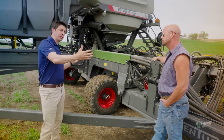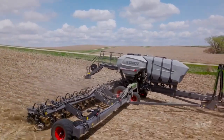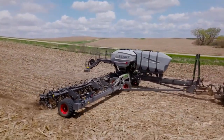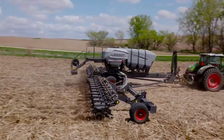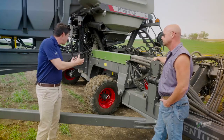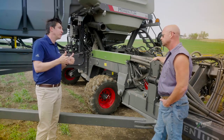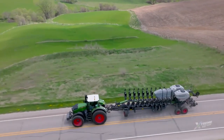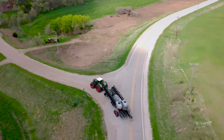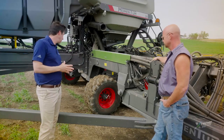The weight we're measuring on the planter isn't just feeding the weight transfer — it's feeding the tire inflation system. As we're planting in the field, the tire inflation system goes all the way down to 15 psi, stretching and elongating that footprint. When we have a bigger footprint on the ground, there's less compaction and more traction. When you finish the field and fold the planter, we know you're folding and going to road, so we'll inflate the tires all the way up to 45 psi. You can transport between fields as fast as your tractor can go, and it automatically reinflates the tires — automatically adjusting as you fold or unfold the planter.